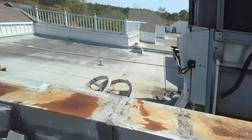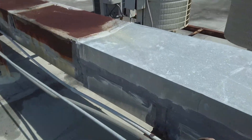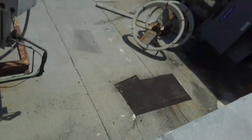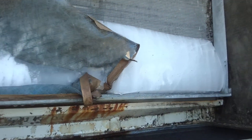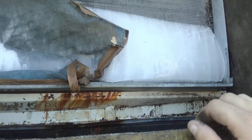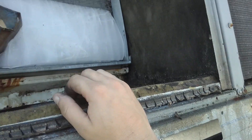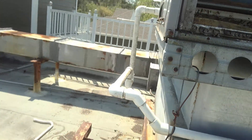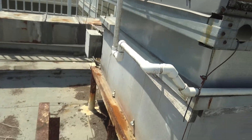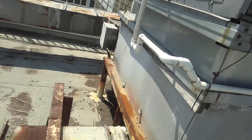It still has ice on the coil though. In the meanwhile while it's thawing out, I need to get some filters because it's frozen there solid — oh my goodness — and that's dripping down the return too. The water's really got no place to go because it probably froze all the way down in there. It's hot up here on this roof.